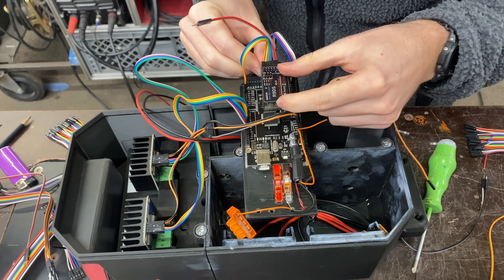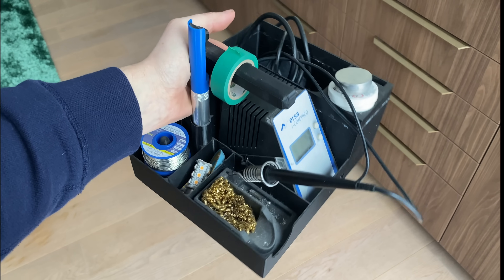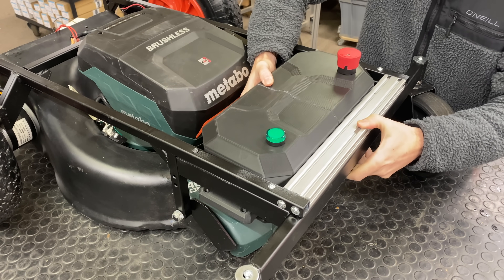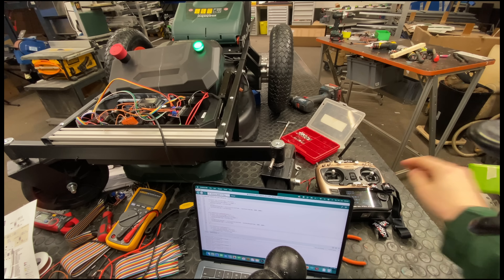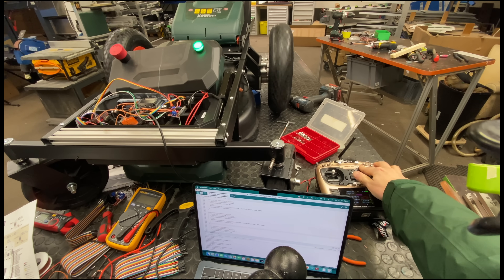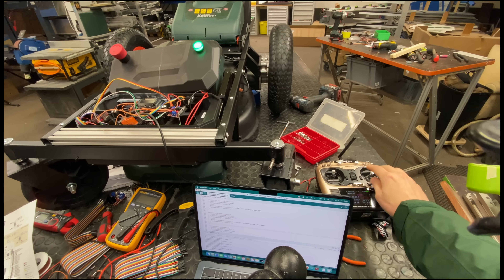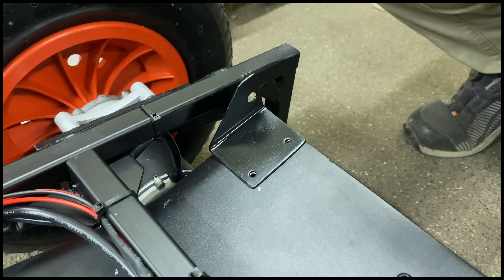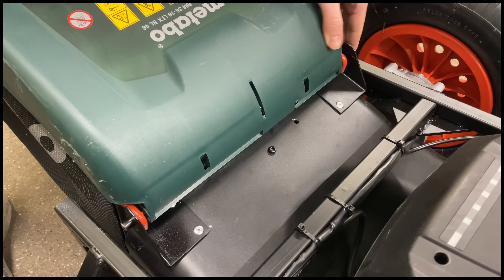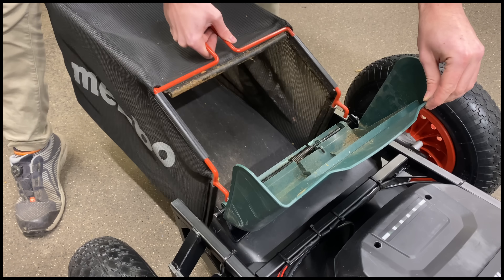I added all the cables off camera because I really needed to concentrate to get everything correct. I built this little soldering caddy a few years ago and that really helped during the process. After that I had a nice electronics box that I could screw to the frame with everything inside. I could start with the programming which turned out to be much more difficult than I anticipated — I wanted to control both motors just using one stick and to use acceleration, and it turned out that it is not as straightforward as it sounds. The final building step was to add these two brackets so I can reattach the basket again, because I really want to pick up some leaves in autumn.